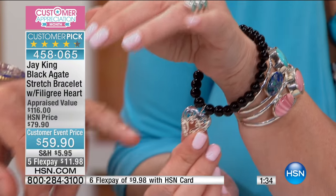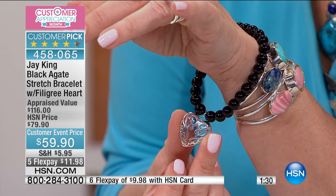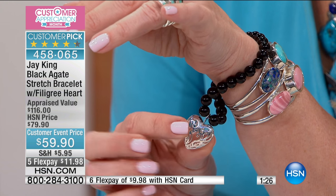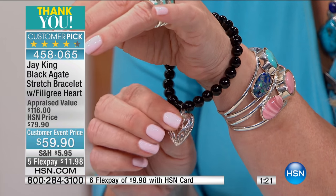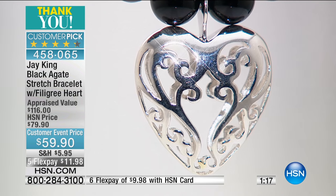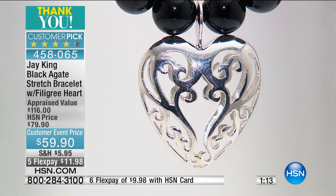These are all hand done in a filigree. It's actually two pieces that the artist makes — they cut it out, make it concave using a ball peen hammer and a die, punch it out, then solder the two pieces together. And I dare you to find the seam — that's why you can see through it.